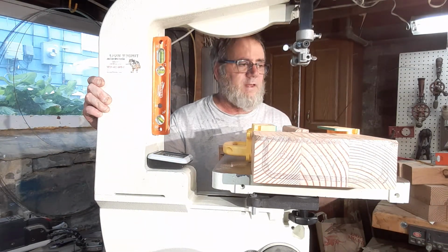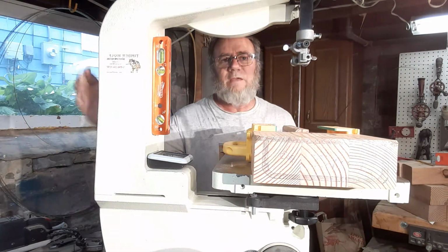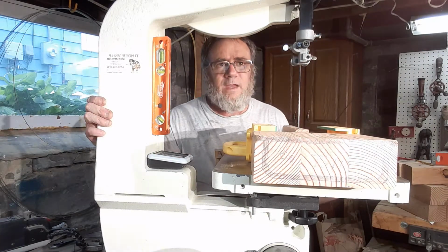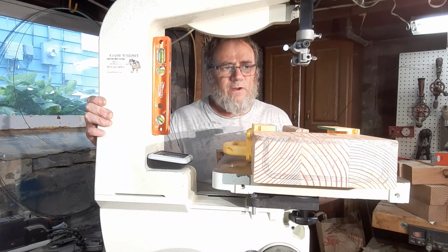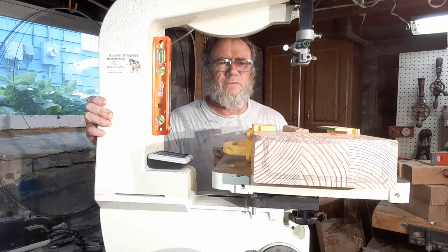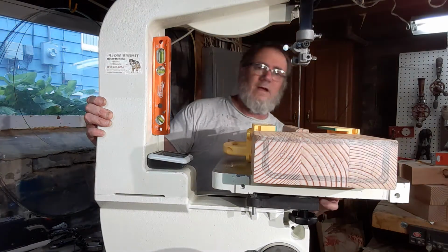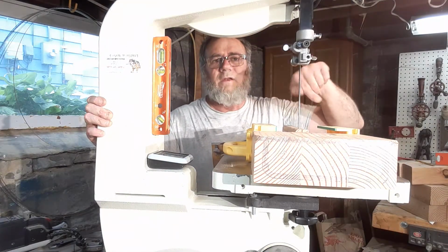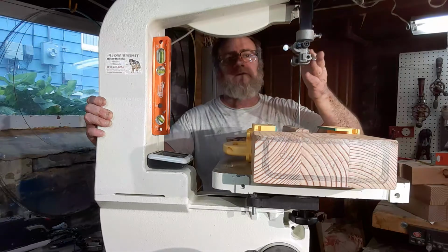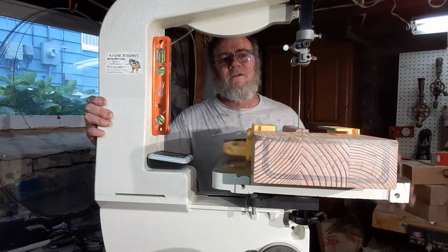Some subscribers have said, hey, you don't have to take the table off when you're replacing the blade. And my mind was trying to wrap around, why wouldn't you do that though? It's going to be very difficult to get at the adjustments underneath. You know, these things need maintenance over time. You're going to want to get to these bearings, the side and the thrust bearing underneath.